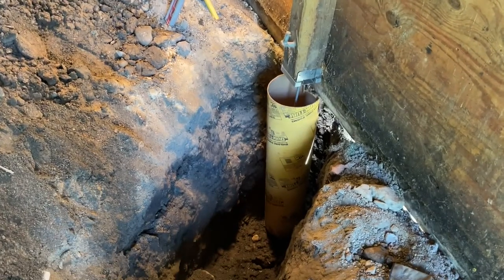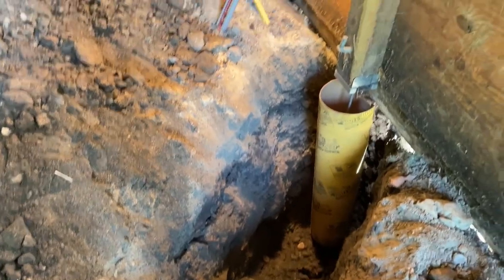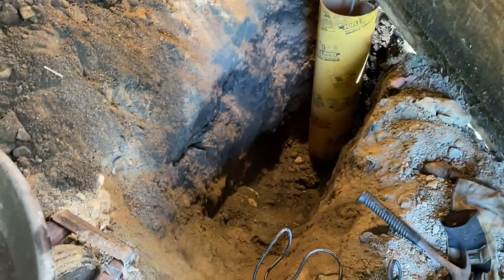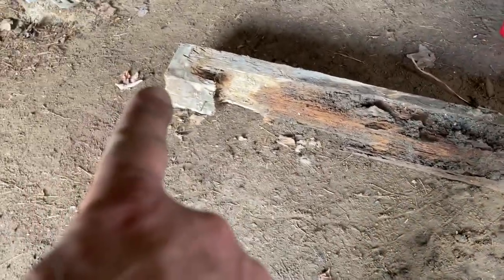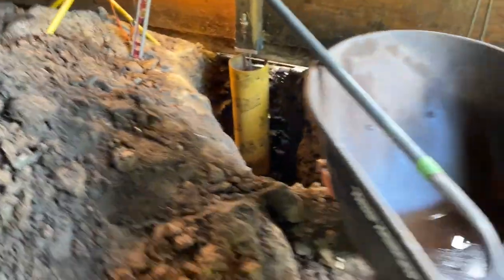What I've done is I have dug down - these posts went straight down 52 inches. They were not in concrete, not sitting on concrete, they were just down into the dirt below the frost line. I have dug that out and pulled the post out. I'll show you what was there - it's actually kind of scary. This was the post bottom, this was where I cut off, but look at the rot - the whole outside of the post was gone, just shredded.